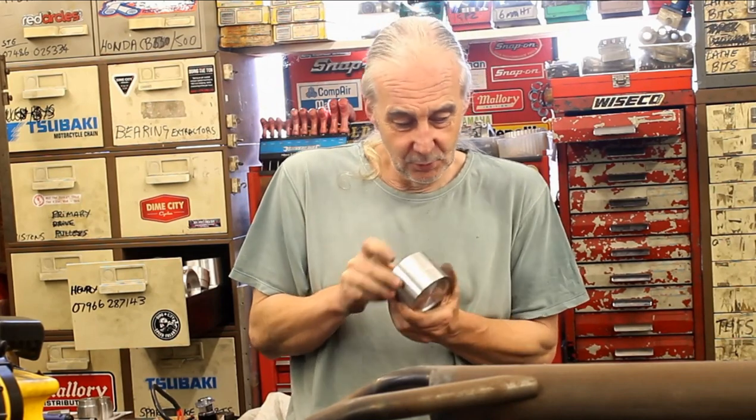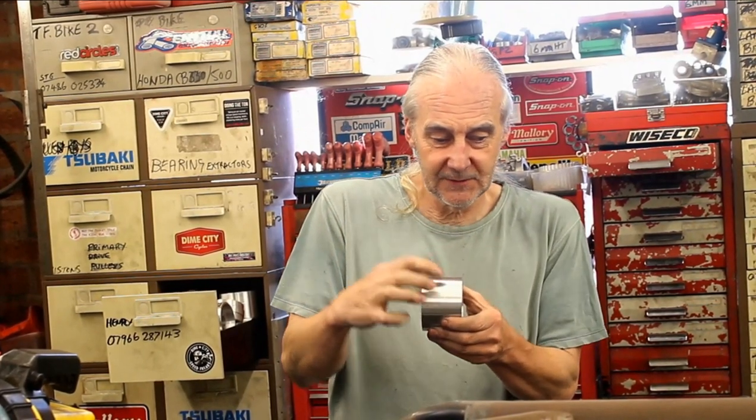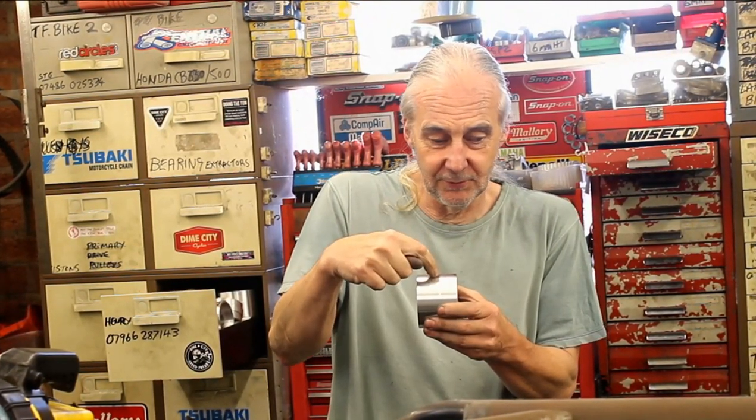Well, I make a few extra because when you're setting up, it's always better. Yes. Use your spare, not the actual one. Well, that's 70-75. Right, okay. So what they've got to be done, they've got to have the good gudgeon pin hole through them. Yes. But I've got to get a special tool. I'm looking out for a small adjustable honer, because to hone the pistons and the rods. Yes. They're very expensive.